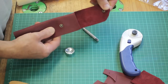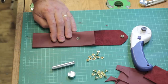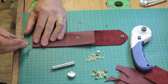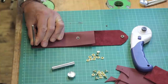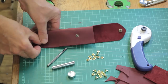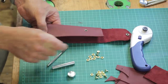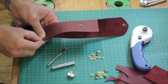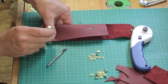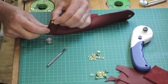The next stage is to put the little rivets down the side and along the base to actually make this sealed up. I use the little punching tool and start down at the corner - same principle as before. Tap it and out comes a nice hole. I take one of the little brass rivets, push it through, find the cap, and then the base plate down - try to get that as central as I can. Top piece in and tap it home. That's the corner riveted.